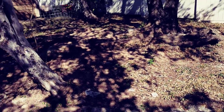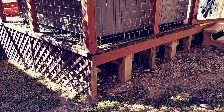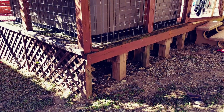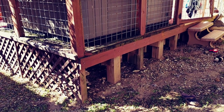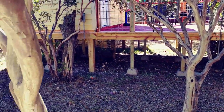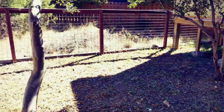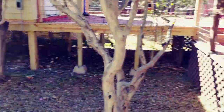You may not be lucky enough to have that situation. What you want to avoid are tree roots. I have dogs that hang out back here so we don't really have a lot of grass in this area. If I did, I would want to avoid draining it on nice parts of the grass. You also want to avoid draining it near the foundation of your house. My hot tub is on a deck, and you definitely want to avoid draining it right by the foundation of the deck. You don't want 600 gallons to suddenly flood a small area and risk the ground shifting, especially with the weight of the hot tub pressing down there. I'm going to drain mine back in this no man's land — branches, rocks, and cactus — still a good distance from my neighbor's yard.